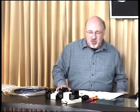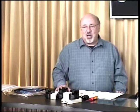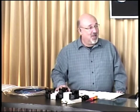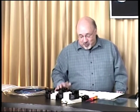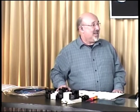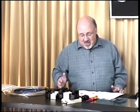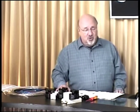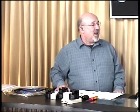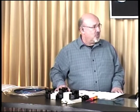switch. And real quick, I didn't want to get too deep in this, but you'll notice on the slide that we use an AMR sensing technology. Basically, what that stands for is anisotropic magneto-resistive. Versus, in most cases, some of our competitors, they use a GMR, which is a giant magneto-resistive type technology. The reason we selected AMR for our choice was that it offers more sensitivity, and in the long run it has a lot better repeatability. So if you see AMR in our literature, that's the type of sensing that we're using for our sensors.